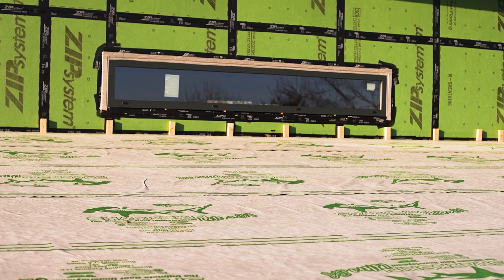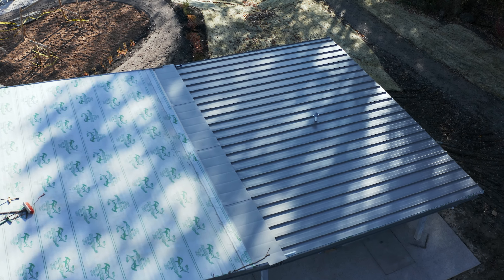Your details should include clip spacing so you know how many clips you need, and that drives two screws per clip, so you need all those screws. All your perimeter flashing needs to be accounted for. Before any of that happens, that roof needs to be fully dried in. I get on roofs for drying inspections and it's not even completed. A lot of problems we run into are from incomplete work — that's a tragedy. Having all the pieces and parts to get you to the end is super important.